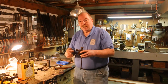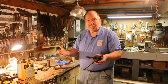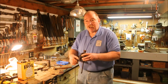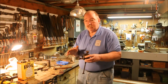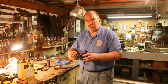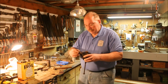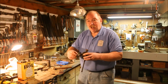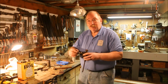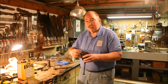Now when I was a kid, I wanted to fix a one-and-a-half horse cast iron Briggs and Stratton engine that I had, and I wanted to seat the valves. I was a kid — I didn't really know what I was doing, I was like 13. So I ground the valves until the point where they were completely seated into the head of the engine. They worked, but not very long. I had made a hundred percent contact — there wasn't any place for that valve to go. Once it wore a little bit, it actually hooked into the hole and stopped sealing. I blew the engine up long before that happened, but that's what you do if you run the valve grinder too long. You just want to put a little white frosted line on the valve from where the grinding compound just cuts a little groove into the valve itself and makes the two surfaces mate together.